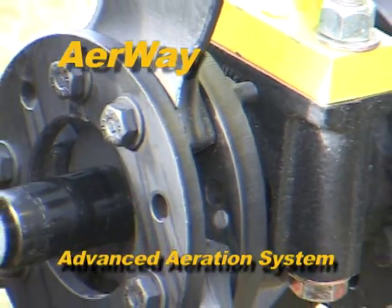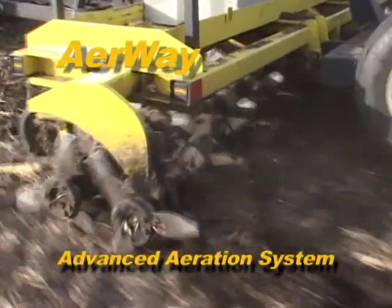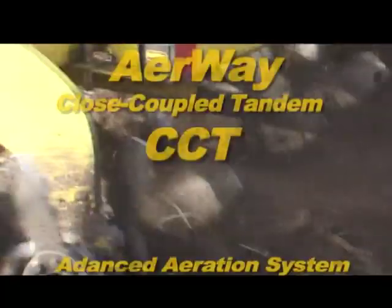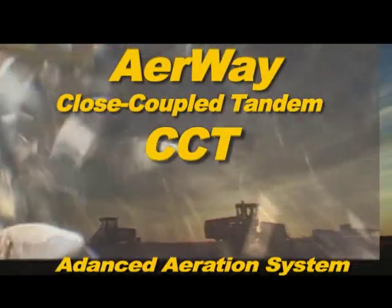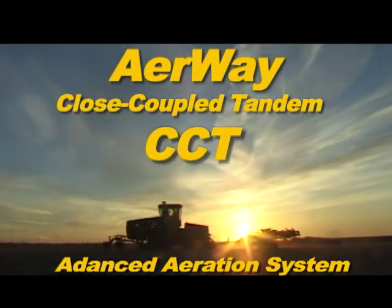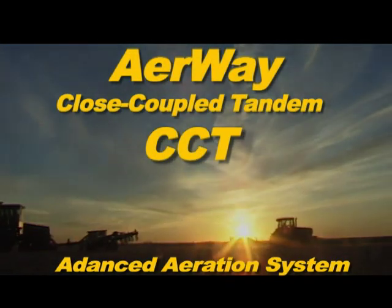Compaction is one of the biggest yield robbers we have as farmers. AerWay can fracture that compaction 8 to 10 inches the first year. Water percolation in years to come can soften compaction down to a level of 18 inches or more. You can see by owning an AerWay close-coupled tandem, higher yields and more profit can be yours.